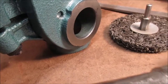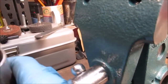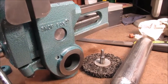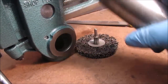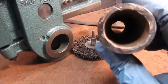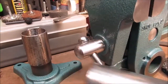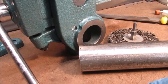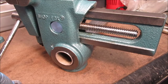It's thin - I want to show you that. This is not going to be for heavy use. It's to be a multi-purpose vice for my projects - hatches and different things that I can move and manipulate. It's a heavy galvanized pipe, pretty thick walled - I'm not a plumber but I worked for one. This will be welded here. Don't give me lectures about zinc poisoning - I'll grind as much off as I can and it'll be welded outside. There's no breeze so it won't affect my MIG gas.